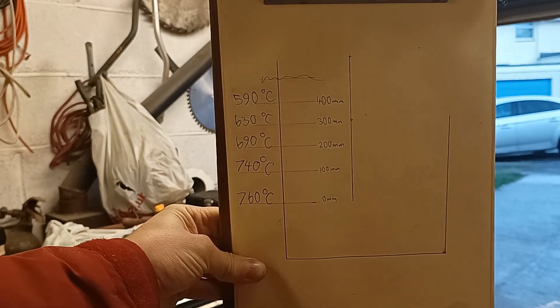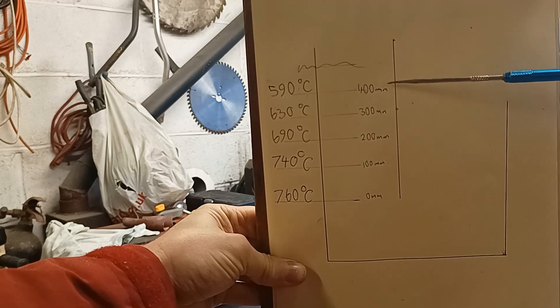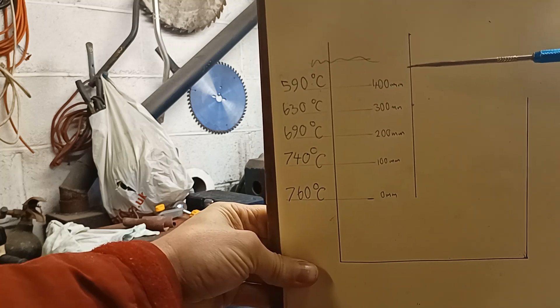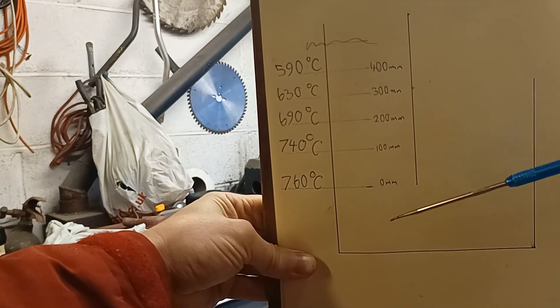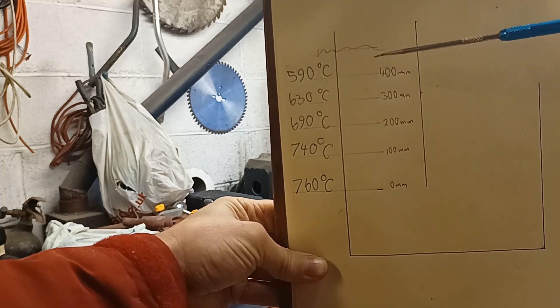Last time I was trying to work out where to put the heat exchanger. I measured all these temperatures with a temperature probe while running our little rocket stove. I've decided, after a few comments from various people, to put the heat exchanger right at the top here, so that the rocket effect can take effect and all the gases can burn up and go up the riser before they actually hit the heat exchanger.